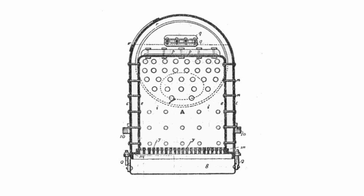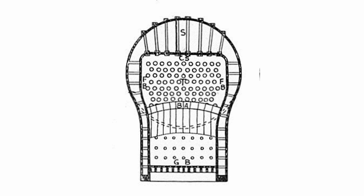the steam dome. Thermal expansion was a problem for these long rod stays, both in their expansion tending to elongate them and reduce their staying effect. Also, as the inner firebox expanded in length, this would bend the stays forwards. Where a long firebox was stayed, the forward rod stays were replaced with sling stays, a rod stay with a hinge at the upper end, allowing it to move forwards with the firebox.